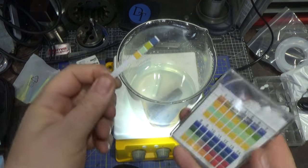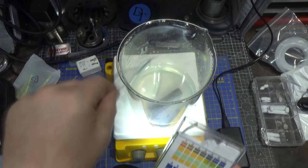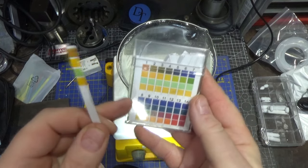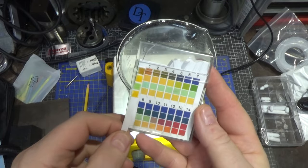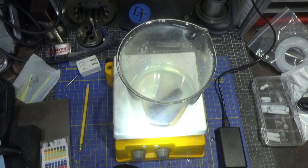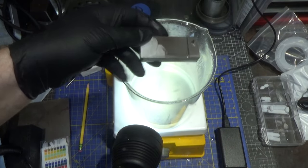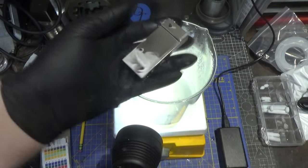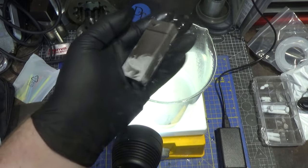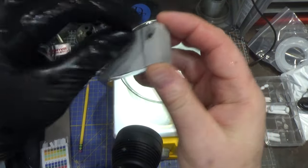After 20 hours it's not completely dissolved, but we kept the solution hot. I thought the potassium hydroxide — a strong base — would be the dominant ion in solution, but it turns out the sulfate ions and hydrogen gas are forming sulfuric acid, which is a fairly strong acid. We can verify this with pH paper — dipping it in gives us a pH of 2 almost instantaneously. Smaller numbers are acidic, larger numbers are basic, seven is neutral. So pH 2 is a fairly acidic solution — that's one drawback. Time to put on gloves and remove the part.